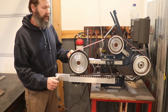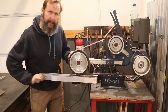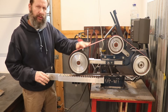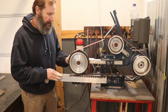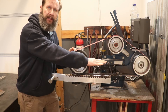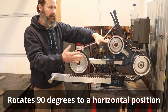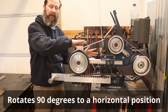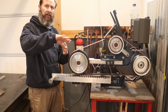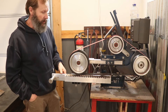My goal with this grinder was to have it operating in the Y direction here, so all the grinding dust is going out the back of the machine. This is called the TW90 for a reason — the grinding wheel will tilt up. If I had it going down or at an angle, all of that dust would be going into my shop, and I didn't want that. So that's why I did it this way.